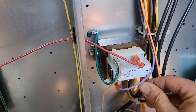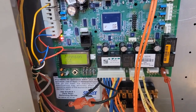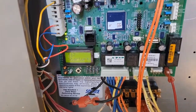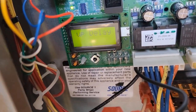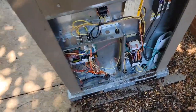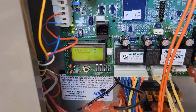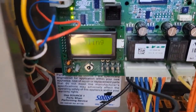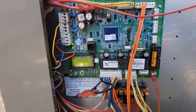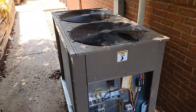Power's gone; plugging the contactor back up — 240 volt Johnson Controls JCI unit. It does a countdown from 120 to zero, then a startup delay, and it's working. Before, after startup, it would always show a sensor failure right there like in the beginning of the video. Now it's not there — we no longer have the issue and have fixed this equipment.